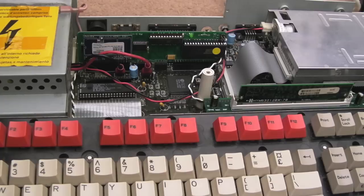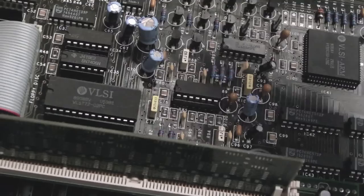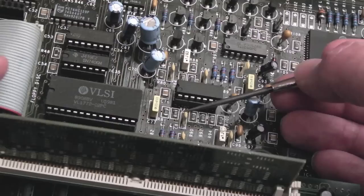So with regards to the volume level, I inspected pretty thoroughly around here, and I can't find anything. And I've noticed some things here, and I don't know whether this is from whoever did the audio mod to this previously, or whether it's something I did. There's a corner of, I think it's one of these caps here, is it this one? There, chipped off, which could be affecting it. It's only 1 nanofarad, that. So I've ordered a ceramic to replace that.